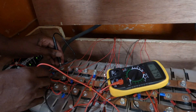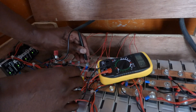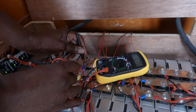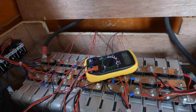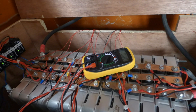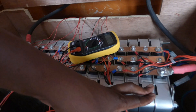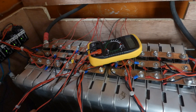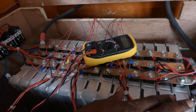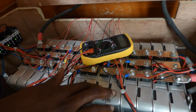Here's another set: 7.74 versus 7.76–7.77. The equalizer and balancer will take a day or two to bring them up, so we'll give up some capacity over that time. Once everything is back to normal, we'll return to the standard charge voltage. If I had a BMS, it would simply stop charging when the highest cell hits 8.15 volts — while the others are still in the sevens. The equalizer, by contrast, doesn't stop the charge; instead it moves excess from the higher cell into the lower ones.